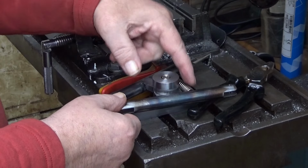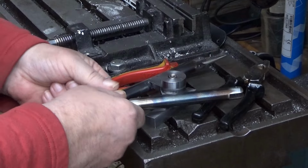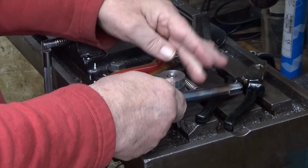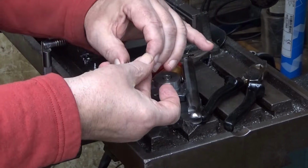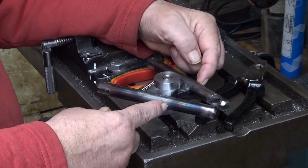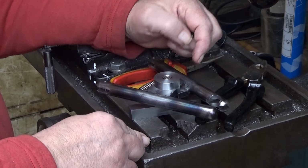Oh yeah, and this spring is needed to have a constant tension here to keep the tensioning mechanism in place. If you don't have a spring in here like that, they will be dangling in the wind, and the tensioning mechanism will drop out. So that's the purpose of this spring. Well, I was also thinking that you could put a spring in between here and then stretch it. That's one way to do it, yeah. But then you would have to drill a hole all the way through these bars and then make something bend here so that it stays in place.